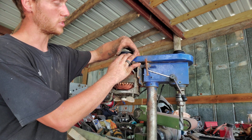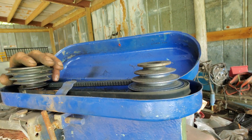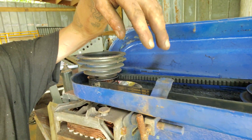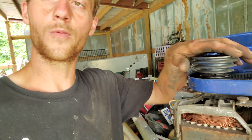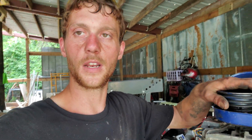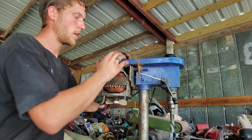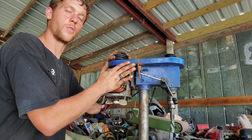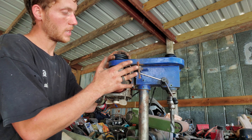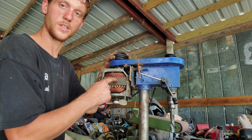There are also some things about these drill presses — you can change the belt to different positions on the pulley, and it changes the ratio for different speed and more torque. I've got this one set for a lot more torque and lower speed. I've found with aluminum that works better for me, and with this particular motor that makes it work well too. Keep that in mind if you decide to do a project like this with one of these motors — make sure you gear it properly.